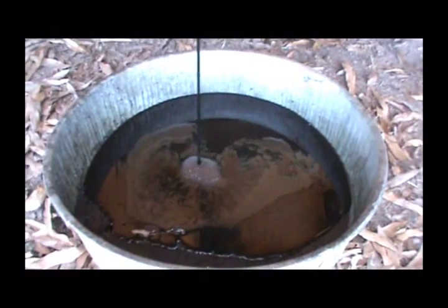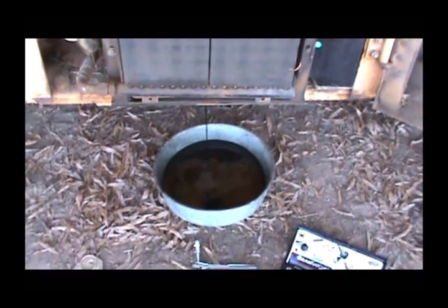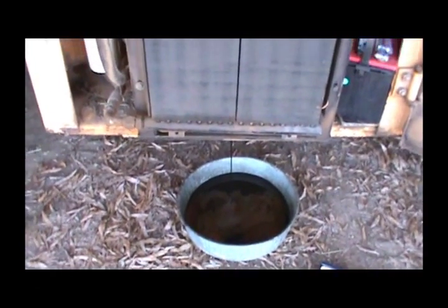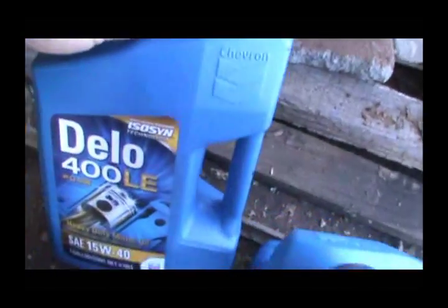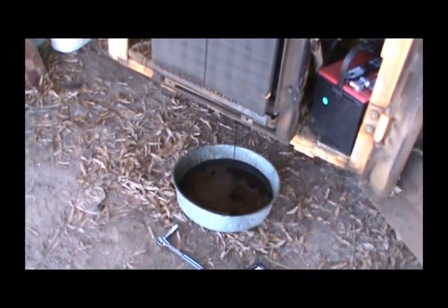There's your oil. I don't know how much oil goes into this machine, and I've got two gallons of Delo. I don't normally use Delo — I like Rotella — but Delo was on sale when I went to the store. So Delo is what's going in here. We'll get this drained out. Our filter is real easy to get to, right there. We'll change it out. The filter is a Napa Gold 1334, and the Delo is 15W40 diesel motor oil.